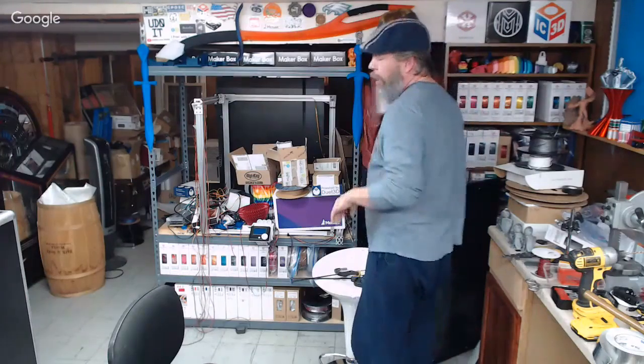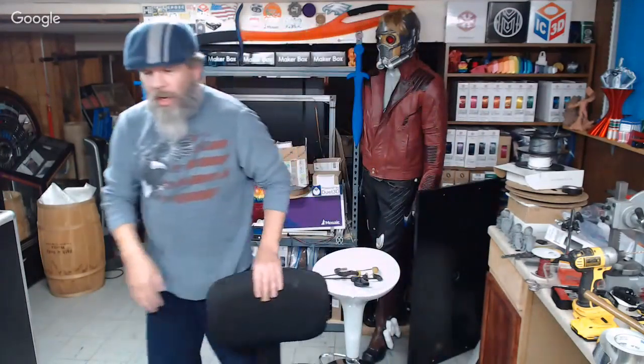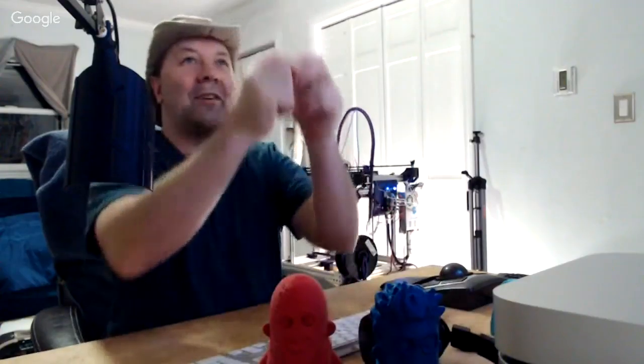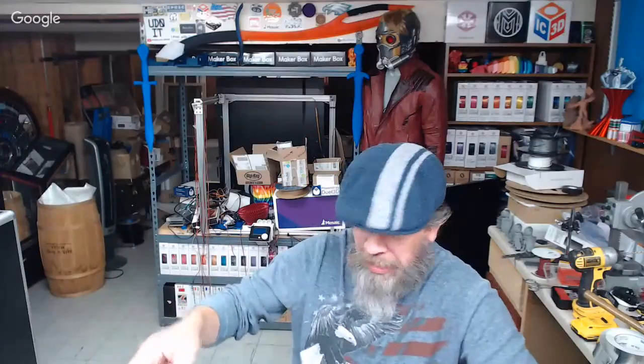And he handed them out, and a lot of us went back, and like I said, the first thing we did, we went and printed with it, and we discovered the slug, which scared the crap out of all of us. When it pulls back out of the nozzle, it starts coming out, and all of a sudden it starts going back. You're like, that's going the wrong direction. That's kind of cool. And then, as most people find out, the first time you start printing with it, if you treat it like normal PLA, it's going to start jamming and stringing. See, I don't have any problems with it. I use the exact same settings as I always do.